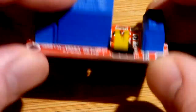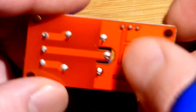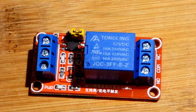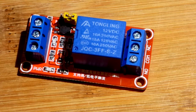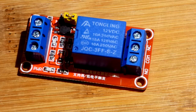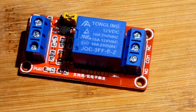There's a bunch of pins showing down here and I don't want to accidentally make a connection to any of these points — that's a close-up for that. Hope you found that interesting. Relay is pretty simple, especially these modules. Trying to wire up stuff directly to the relay is quite a bit more complicated. There's a bunch of pins on the bottom. These relay modules are actually about the same price as just buying the relay itself. So unless you absolutely need just the relay and the module has stuff you don't need, I suggest just getting the whole module — it's only a little bit more than the price of the relay. Trying to build all this yourself is going to cost a lot more, so buying a pre-made unit like this is the way to go in my opinion.